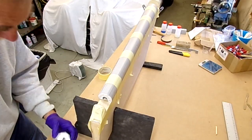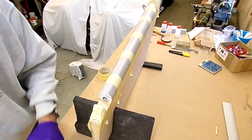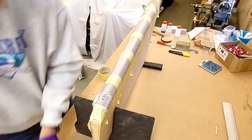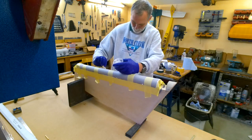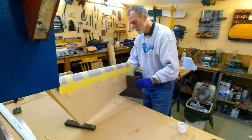This is the replacement chunk of foam I got that was just a rectangle, and I had to shape that. It's quite roughly shaped, but it'll sand down nice and easily, held in place by tape. And here I am just going down, removing the squeezed out micro balloon from the sides.